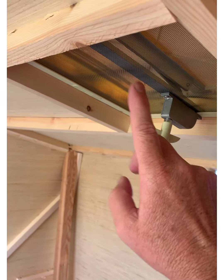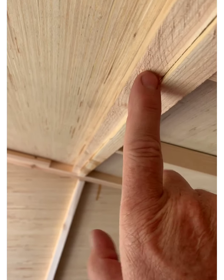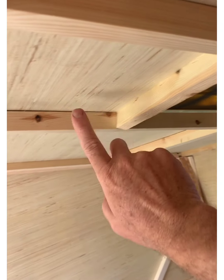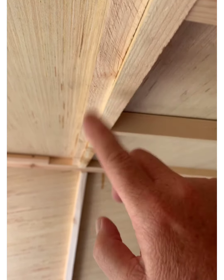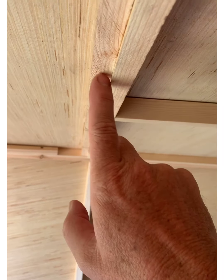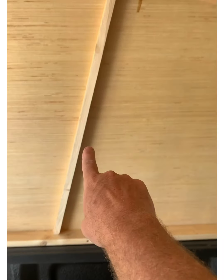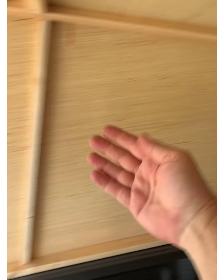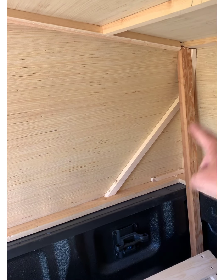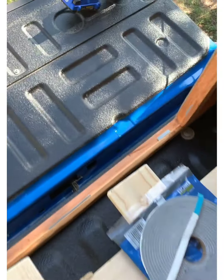I ordered this, and when it came in, that's when I built this part of the frame. I added this piece just so it wouldn't flap up and down — this is a 4x8 sheet piece, and it stops here, and then this is another 4x8 sheet piece. This is wider than 4 feet so I had to use two sheets that come together right there. These supports were really just to keep the plywood from flapping in the wind and to add diagonal strength. Once you put the skin on, it starts getting really rigid.